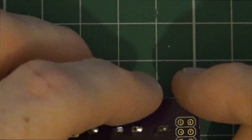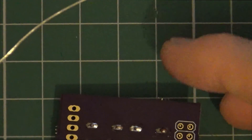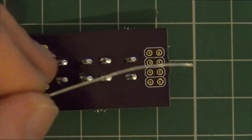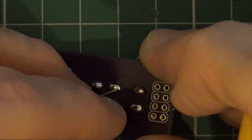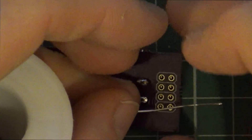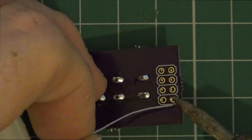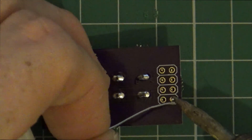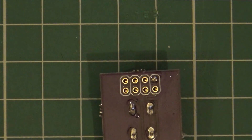Next part is the ESP chip. What I like to do is just move back to the thinner gauge solder at this point. Get one pin in. If you've got some blu-tack or something that helps. Just place a finger on the other end if it starts popping out. It's pretty perpendicular, but if it's slightly askew or at an angle you can just reflow that one pad and move it around as needed.